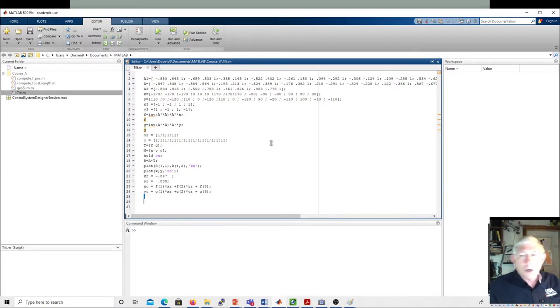We'll do that for both axes, for the x value and the y value. And those equations then, once we go through this calibration process, it's doing a least squares fit of these points to correct for translation, rotation, and scaling. And so it's pretty cool.